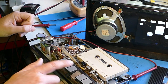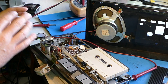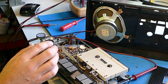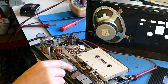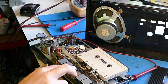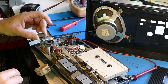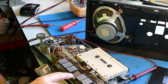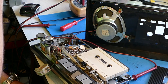Remember I said I've got this problem that sometimes the power supply just shuts down due to an overload, but other times the machine seemed to run. Well I think I might have got it to run. Power supply's in shutdown mode. But if I tap this button, there is a way of getting it to work. We're rolling. So what's happening is intermittently when I'm pressing play we're getting a short circuit. It may be something to do with that switch again that switches the whole deck on. I'm going to look at that. Since I can get it into both the fault and non-fault condition, I want to look at the resistance across the supply rail.